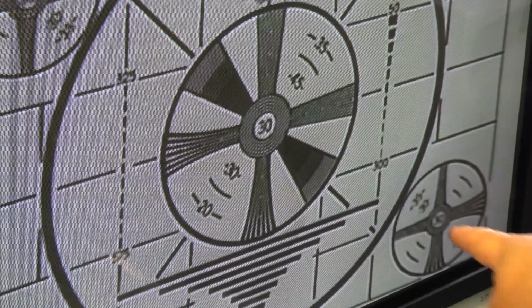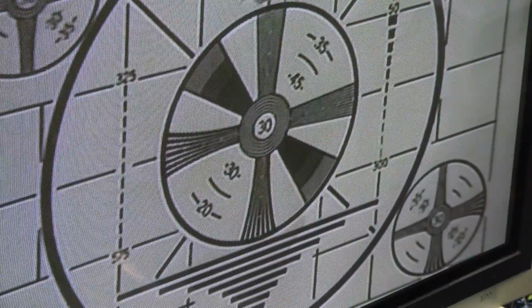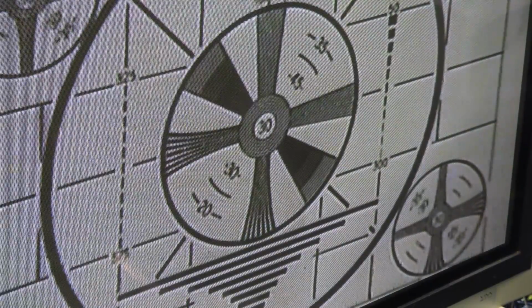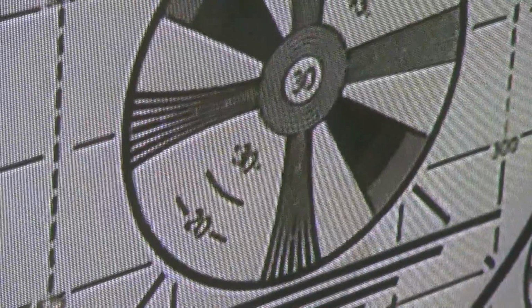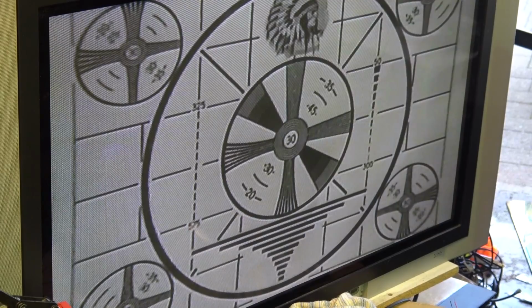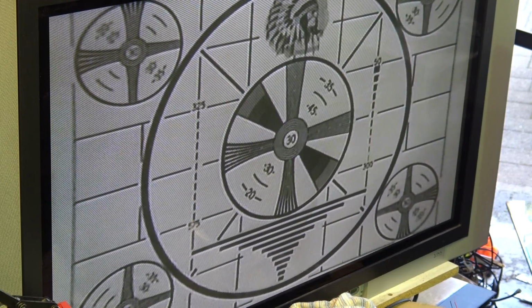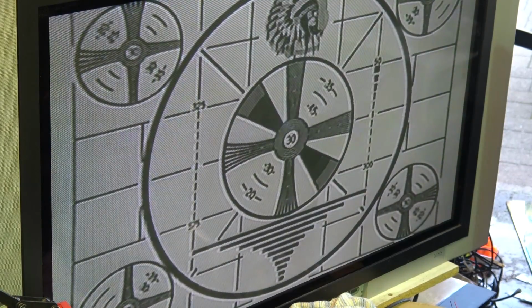I guess the lines we're going to be looking at are these ones down here, not these ones. The ones that go horizontal, those are vertical resolution. Now we're back in. This is still S-VHS, but this is now the EP speed. So what we're looking at is this resolution down near the bottom of it there. That's S-VHS in EP. And when it switches to standard VHS, we will probably see this resolution down at the bottom will drop. The wedges will appear more blurred as we get beyond 300 lines. And as you can see, it is definitely rolling off a lot sooner.